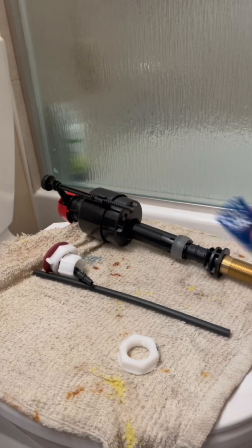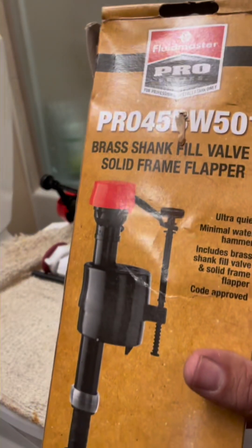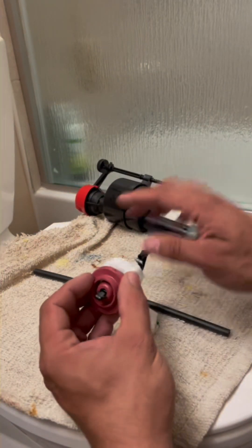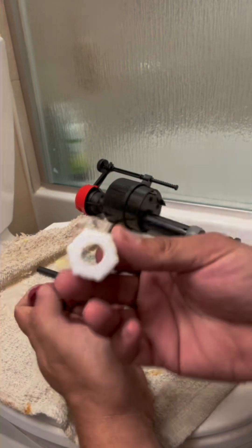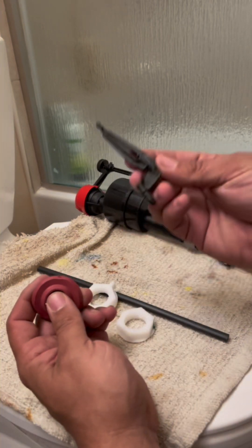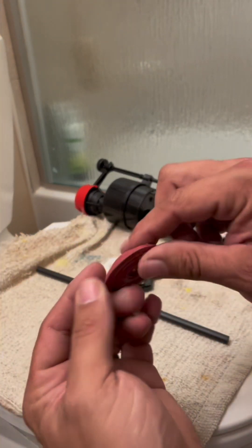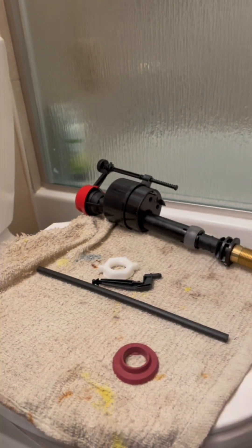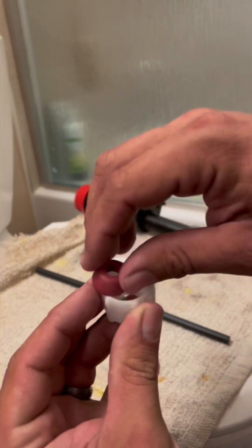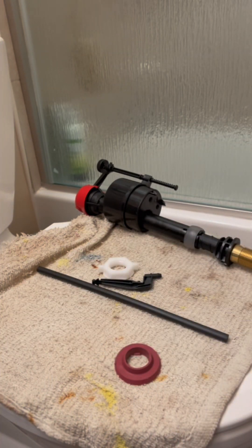Here's the one I'm gonna put in — this goes in the bottom, the old one comes off and it's trash. It's a Fluidmaster Pro, comes in a kit like this. Chances are you don't need that fitting, throw that away. You'll need this part — keep the nut. The old one comes up with this piece, and this piece comes out. This adapter goes in here if you're using that, but we're gonna use the same supply line so there's no point.